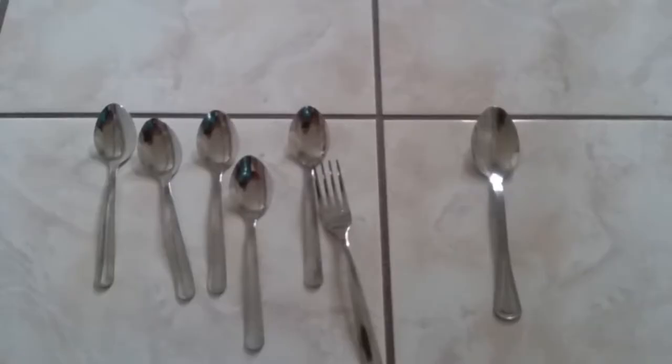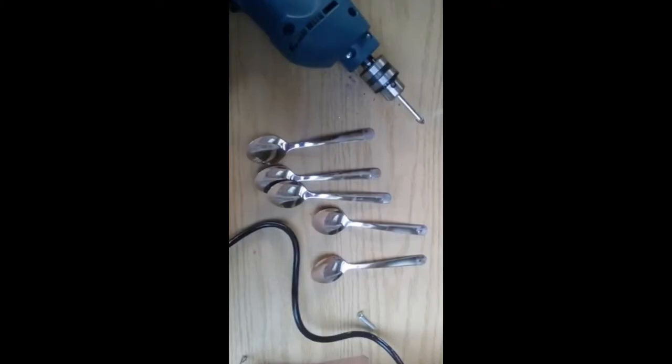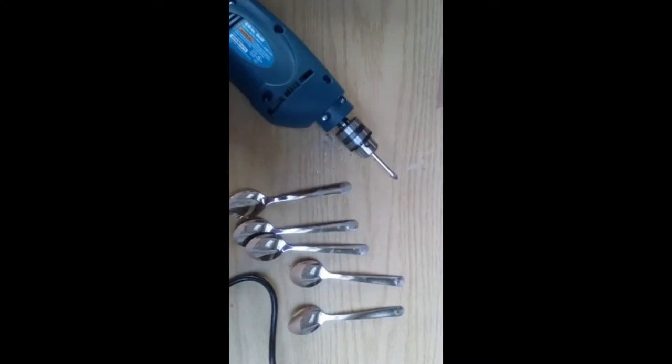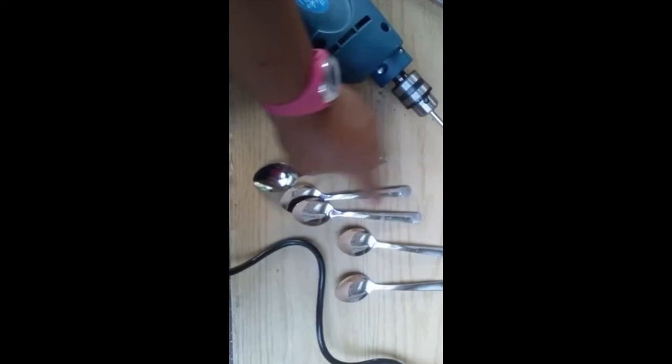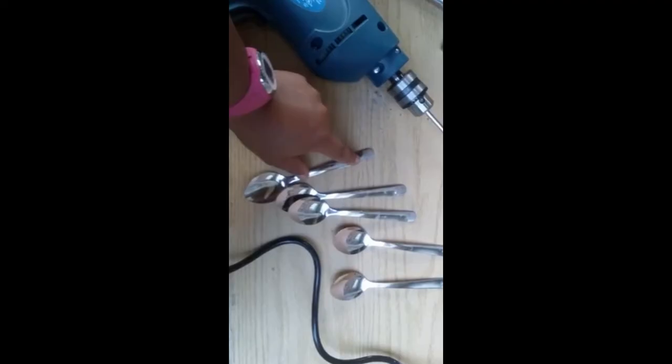Anyway, I just wanted to share this first phase of the project. It's a little noisy out here, so excuse the noise. What I did was take a little screw and hammered it in with my hammer into the back just a little bit to make a pilot hole, so that my drill wouldn't be sliding every which way as I'm trying to drill.